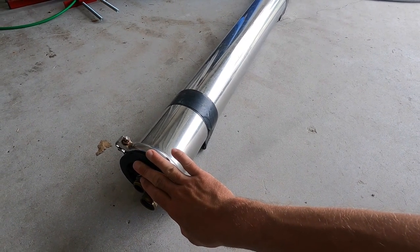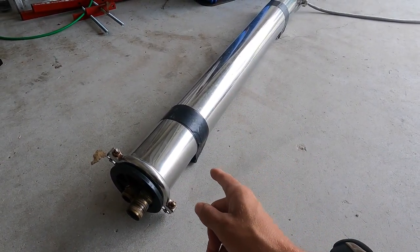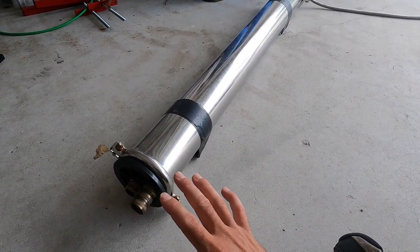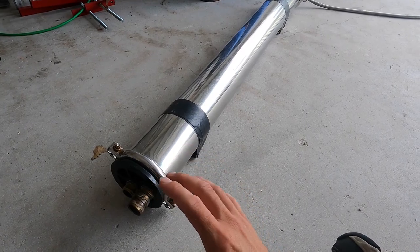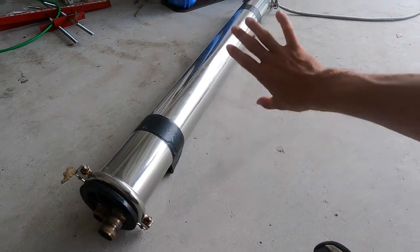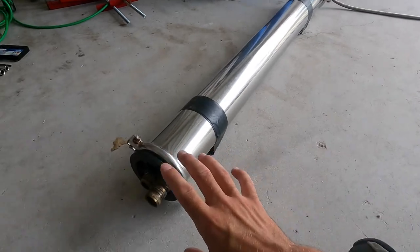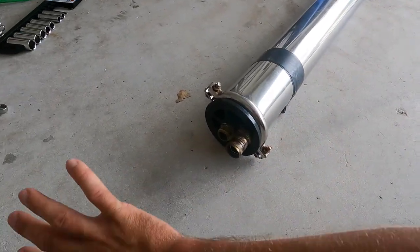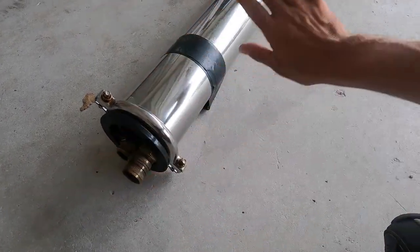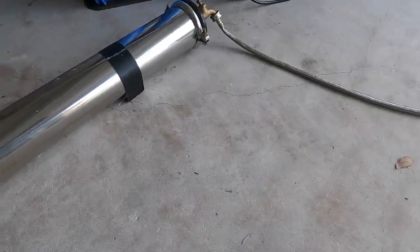And there is one important thing. On these membranes, they have a little black O-ring on the bottom of them. What I've learned is the end that has the black ring or the silicone ring always goes into your back end, which would be your wastewater. So you insert the RO filter in here — obviously this cap's not here and all these fittings aren't — and you just slide it in. Let me show you real quick.